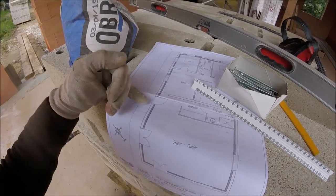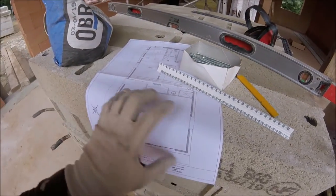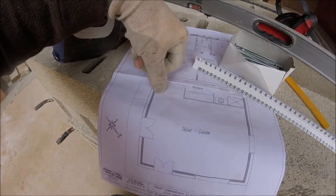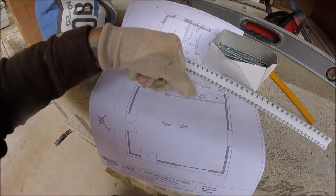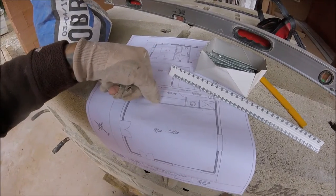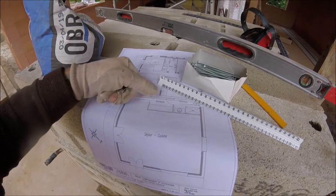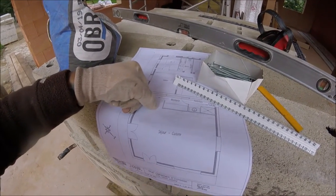On this utility section, what we've decided is we don't need the hallway entrance that big and we don't want open plan, because in winter when you open the door all the cold air rushing in would cool your big living area. So we're going to continue the wall along and put a door in here. Wherever that finishes on a full block it finishes, and then we're going to extend this utility room — it can also be a storage room with extra cupboards.